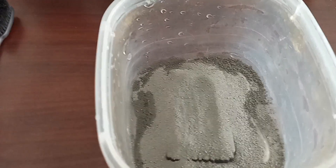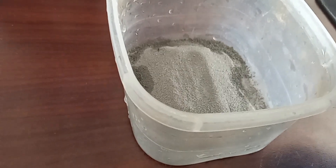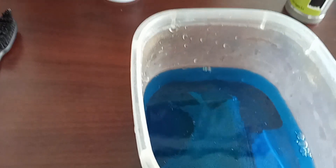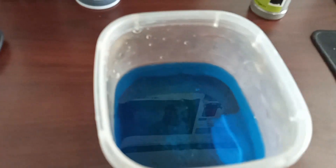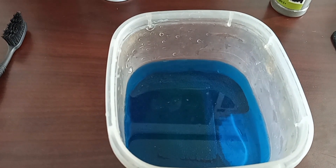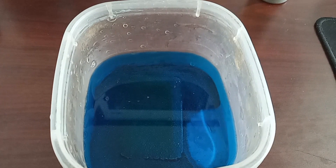This is a little too much graphite coating, but I'd rather do this now than redo it later. I think it's going to plate very well. We're going to pour the electrolyte. What's happening is that due to the iron being in contact with the graphite, the iron is being displaced and a copper layer is being deposited, and because it is in contact with graphite, the graphite becomes plated too.